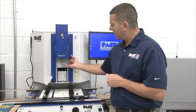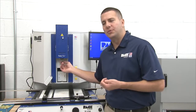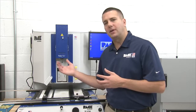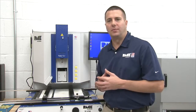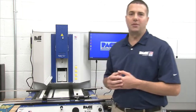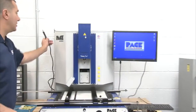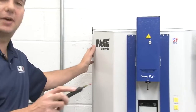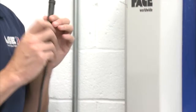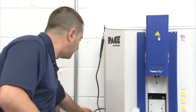That's a quick overview of the top heater and the bottom heater. As I said, our vacuum pick up top, getting back to the vacuum pick, that's used not only for installations but removals. However, in some cases, the vacuum pick on board may not work if the board's warped, if there's raised lettering on the top of the component, or if you have excessive surface tension. So we also supply our pick vac, and this is just a manual vacuum that we can use to remove a component from the board or just for component handling in general. I sometimes refer to that as Plan B.